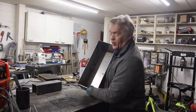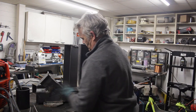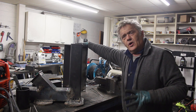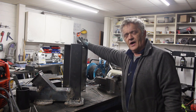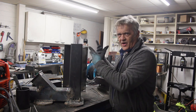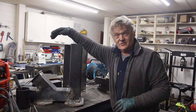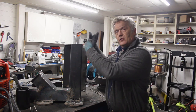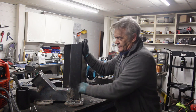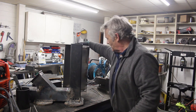And that's the box made up. It's got a hole in the bottom because that goes on this section here. I'll leave the back plate off for the moment because I still need to put in the flue connector. You see people do all kinds of things here — using cylinders, tanks, boxes, all kinds. It's the same principle: as long as the gases are forced by a baffle — maybe two baffles to come round, maybe again before the exit — you're going to be fine. It's the chimney exit that gets connected to your flue in the house. The idea is to create a baffle and force the gases around — one time, two times, three times if you're feeling really crazy. Doesn't matter if it's square or a tube; I tend to leave the gap here the same as the gap there. Anyway, let's put that on and weld it in place.